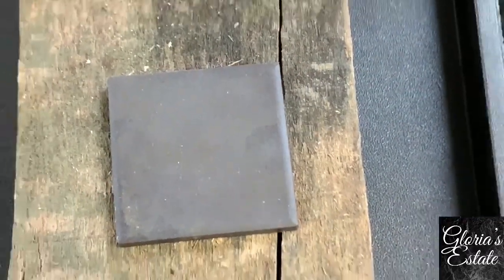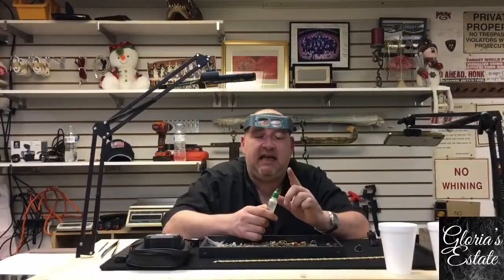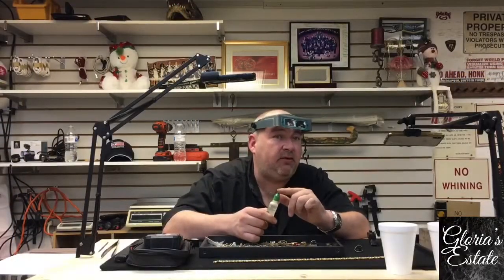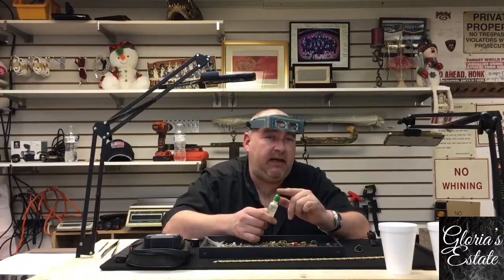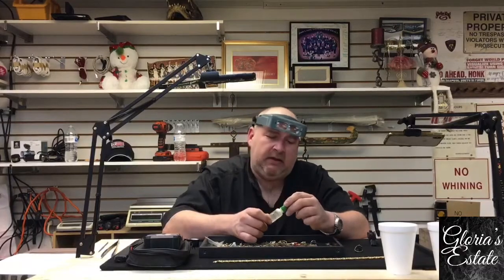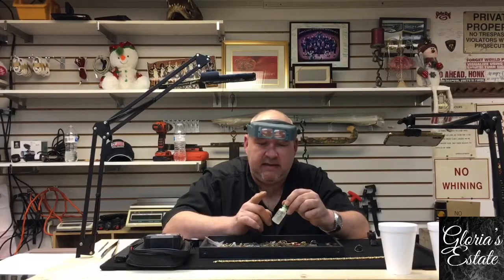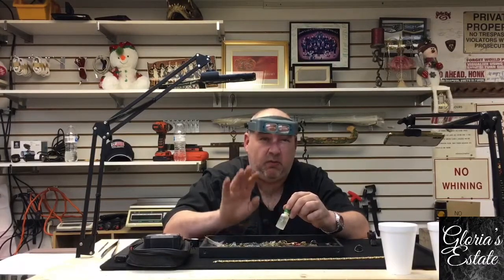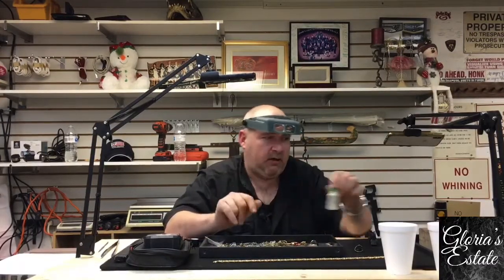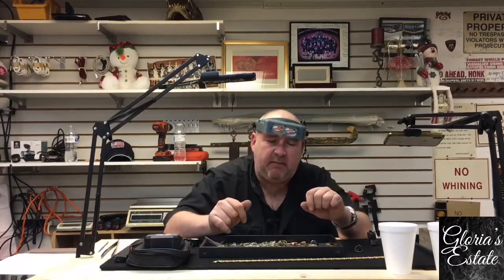which is the acid. So, we use a style of acid, which is a mix of traditionally nitric and muriatic acid. Now, you can get these in different strengths, all the way from 10 carat to 14 carat, up to 22 carat, which will almost dissolve pure gold. So, this stuff is not for the faint of heart and dangerous. So, please use in a well-ventilated area. All right. Let's show you the way to use that properly.